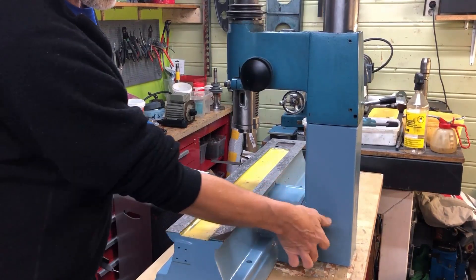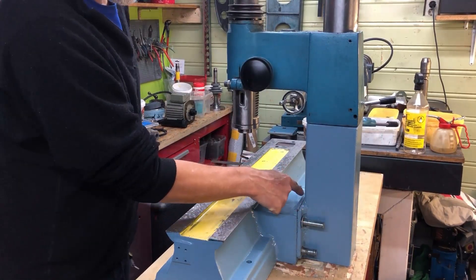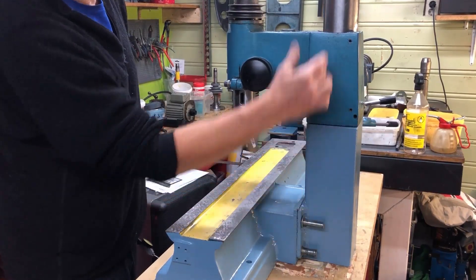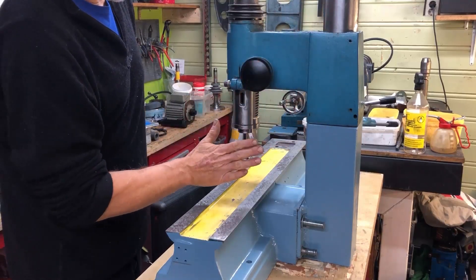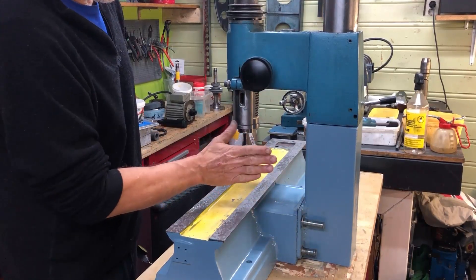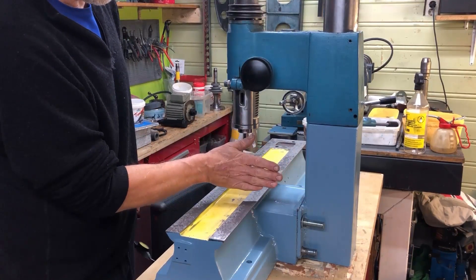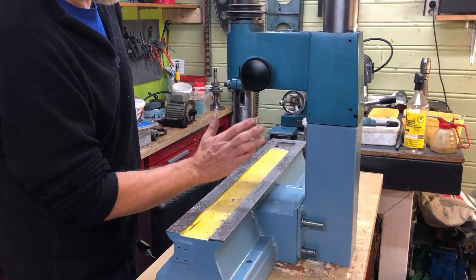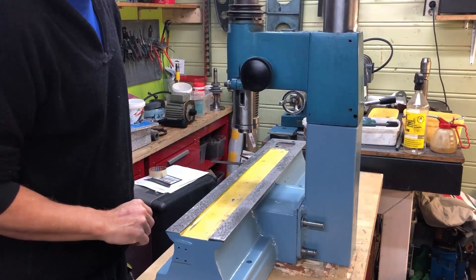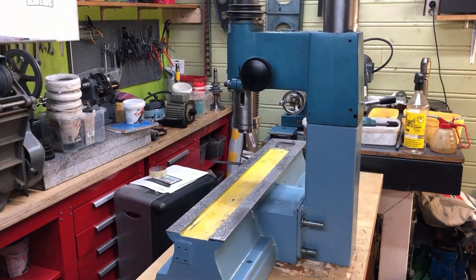The column is mounted and also filled with epoxy granite. The critical part — the two plates that bridge over are scraped to a good alignment and fit. The head that rides up and down the column can be adjusted sideways with the sloppy holes, and in-and-out is governed by how well I've scraped the plates. I measured deflection at the tip of the spindle pushing as hard as possible on top of the column and got around four hundredths of a millimeter deflection. This can be improved by securing the top of the column to the headstock.